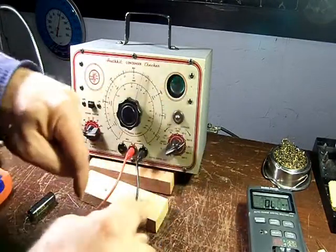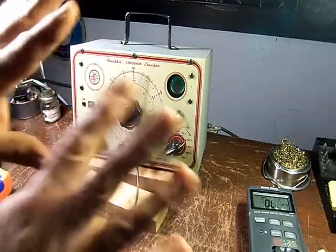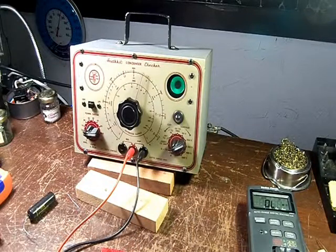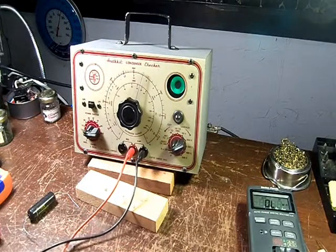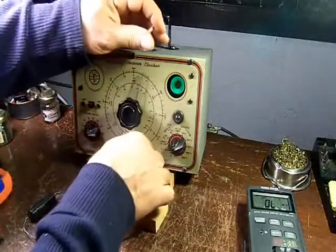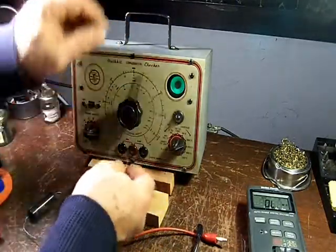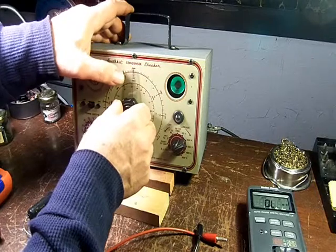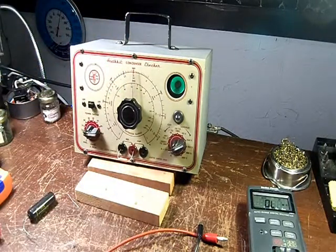You've got to be careful — if you ever run one of these rigs, you've got 200 volts or so across these terminals. Keep your hands off and always turn your selector knob away from the leakage test when done. Here's a 200,000-ohm resistor. We'll put this over here — 2,000 times 100, then add a couple of zeros to the 2,000 and you've got 200K.